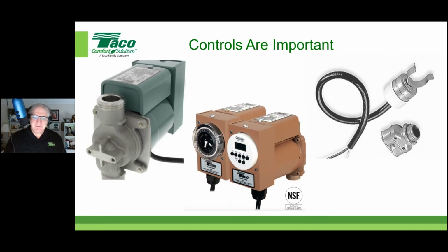A third option is an aquastat, which is actually a pretty good option. Timer plus aquastat's actually not that bad, because the aquastat clips on to the return side of the pump. Once the water temperature reaches a certain temperature there, doesn't matter what the timer's saying, we're going to shut the pump off. All right, that's a good thing. And if the water temperature drops below, let's say 95, then we'll turn the pump back on again. Now, Rick, where do you think the best place to locate this aquastat actually is?